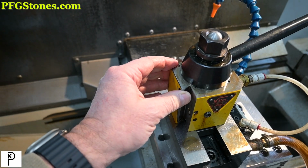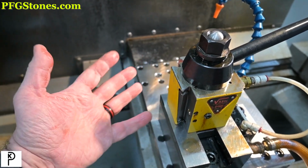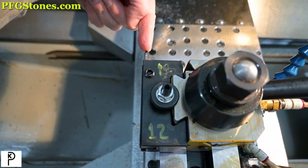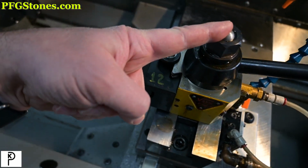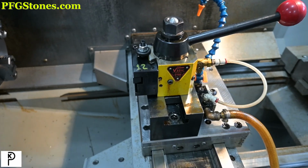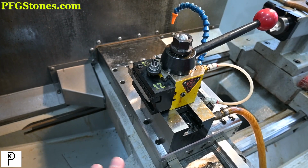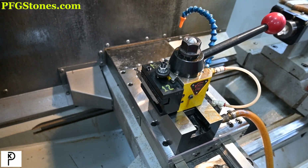And therefore, when we're doing normal lathe work, we really infrequently will encounter those if everything's pretty rugged. And that's what happened to me. I hadn't seen this problem before. But now, because we're taking a cutoff tool and we're putting a force in one direction, that force is trying to torque this tool post around on the pivot. So it's sort of a worst case condition, and now we're trying to figure out how we could improve it. Others have done it. I'm not the first one. See Robin Renzetti, many others. But I'm going to figure out my solution here, and we'll come up with something that fixes the problem.